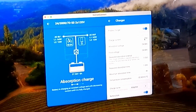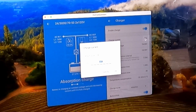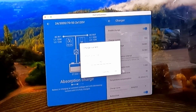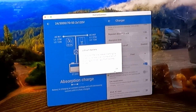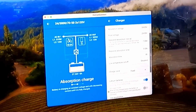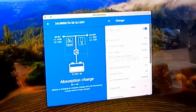Go to charger. It reset to 70 amps. For each one of our batteries it says it should only charge at 40 amps per battery, and we have three of those — so we can charge up to 120 amps. But we're going to put another inverter in, so we're going to set this to 60 so that when the other one connects, that'll be 120. We also have to go back and click on lithium battery setting to tell it this is not an AGM or lead acid. That will change a lot of the settings automatically. I just click on lithium batteries and leave it alone and it pretty much figures it out for itself.